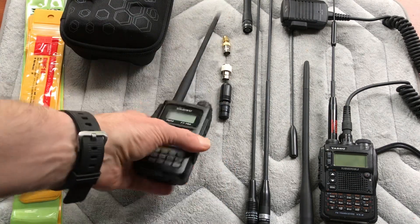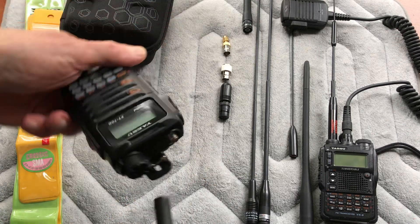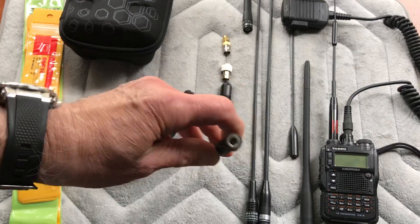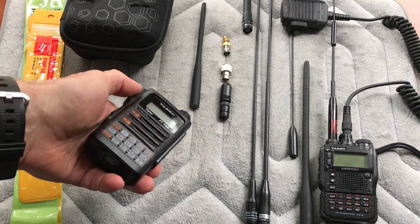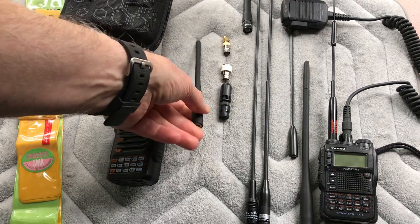On most Japanese radio HTs these days, they come with SMA connectors. You've got the female connector on the radio and then the male connector is what's on the antenna with that little pin inside. Most stock antennas have gain about two or three dB below an isotropic or a quarter-wave vertical. Because of its size, a stock antenna running five watts will actually output around two to two-and-a-half watts on two meters, and around three watts on the 440 band — just because of the size, not the quality.